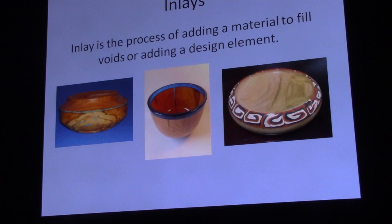They have it out there where they have the acrylic resin. And I just took some powder and colored it, and it'll stick to wood, it'll stick to metal. So for filling those small cracks that are an eighth of an inch, you have to have a little bit of depth. It can't be just a surface thing. It can't be a scratch. It's got to go a little deep. But you can put it on there.